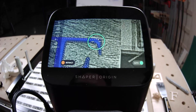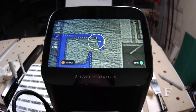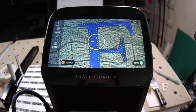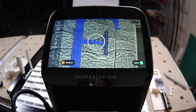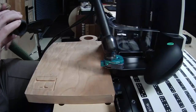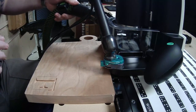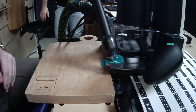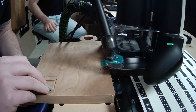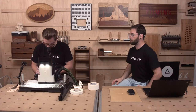Always clean your router bits — we try to do it regularly and we're always happy we did. Now let's see how this fits. Typically for inlay and marquetry, we do approximately a four-thousandths-of-an-inch (0.004") negative offset on almost everything — very small, but it really helps, especially when you have big inlays like the Shiprock inlay where interference builds up between parts.